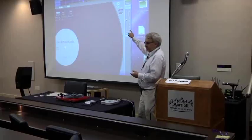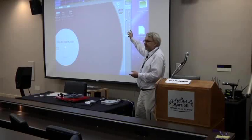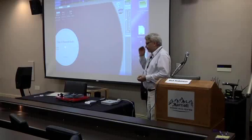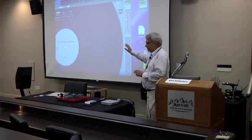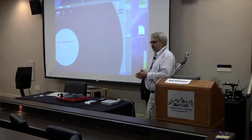So the internal signal chain here is 64 bits. We're going in with 24-bit audio. The RIAA filter increases that to about 26 bits. Of course, you can never use that 26 bits externally, but what that buys you is an extra 2 bits of headroom here, and that's where this minus 12 dB number comes in. 12 dB corresponds to 2 bits. This also comes in handy when you're doing other operations that are possible with the software, which I won't cover. Some of the features like an electronic crossover and plugins, it's handy to have that extra resolution for that case as well.